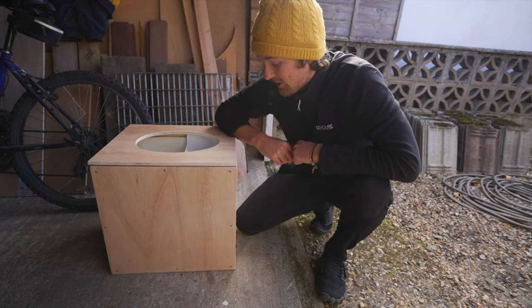So a really important thing to think about is the costs of building it, because compost toilets are so expensive to buy ready-made. Our separator, which was the cheapest that we could find, was £47. The battens were £18 — that was three 2.4m long ones. The 5mm ply sheet, the smallest sheet you can get, was £13. And the hinges were £2.38. It was a total of £80. Things that we managed to get for free because we like to reuse things: the bin, which Beth's parents had an old one we cleaned out; the 12mm ply left over from our van build; the jug for the wee, which we haven't bought yet but won't be too expensive; and the varnish, we have a little bit left over from our van build. So just for us, a total of £80.38, maybe a little bit more if you need to buy the extra things we managed to find left over.